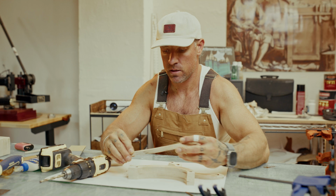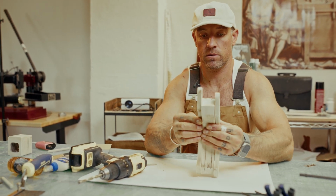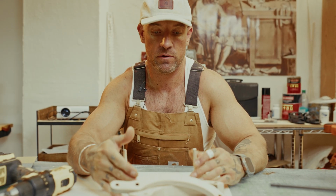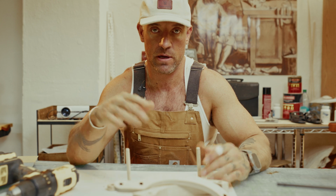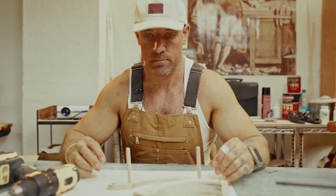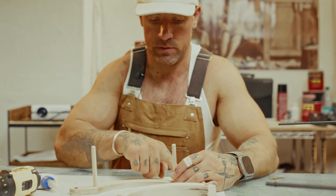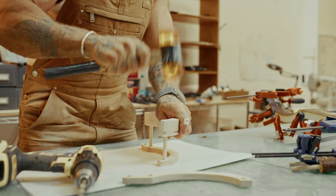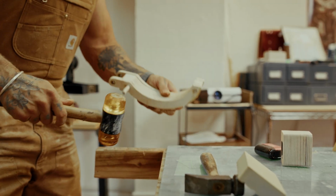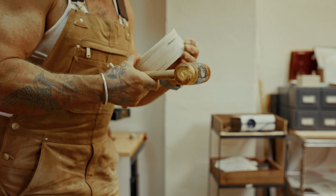So this is pretty self-explanatory, but basically we're gonna sandwich B1s with the Bs. I don't expect these all to line up perfectly because I've sanded a bunch of them, so we're gonna take it to the sander after this is glued up and take off the parts where they don't quite align. Yeah, just remember that last hole right there is for the hinge. Yeah, it's off a little bit, but we'll clean it up.